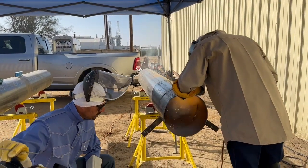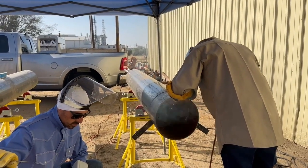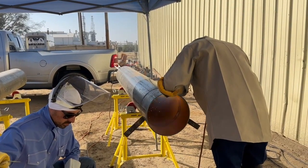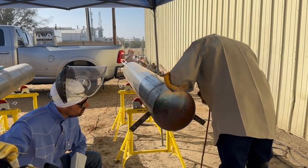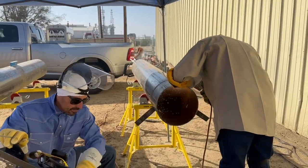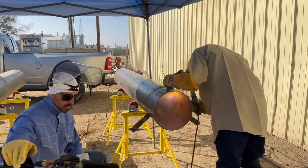Now this top quarter here is a little wider than the previous one. You can't see it too well, but I have my left hand with two fingers around that rod to steady it. When you're stepping or stitching for a wide place, it would be very easy welding one-handed to get out of that bevel and arc into the pipe. So it's a little tedious.